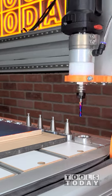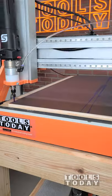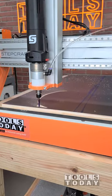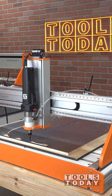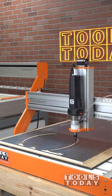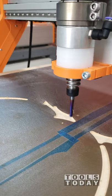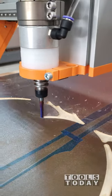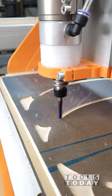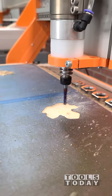We're going to pick up the 46202-K quarter inch down cut bit with the Stepcraft M1000 CNC machine with the auto tool changer. We're going to go through here in several different passes with three different bits to pick up all of the fine details of this piece. Here it's doing all of the main clearing areas, and that's done with the Vectric VCarve Pro software. It allows you to use different clearing bits with a larger diameter, and then move down to the smaller bits to handle all of the fine details as well.